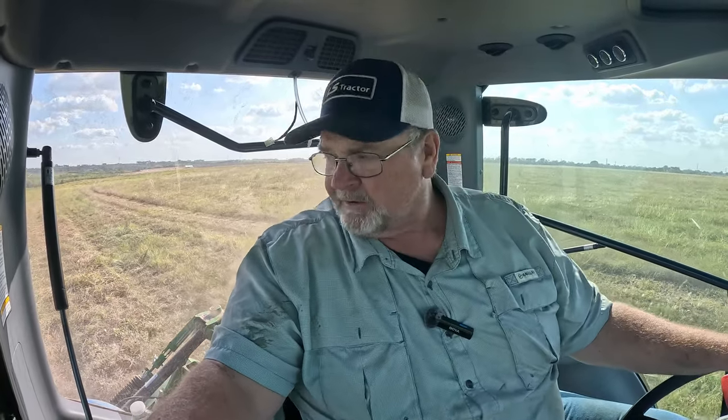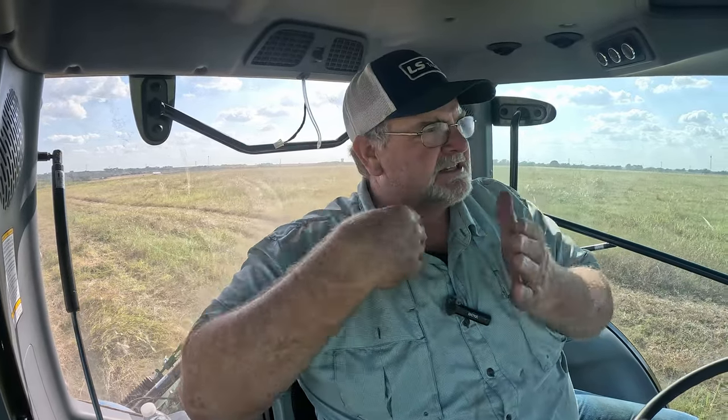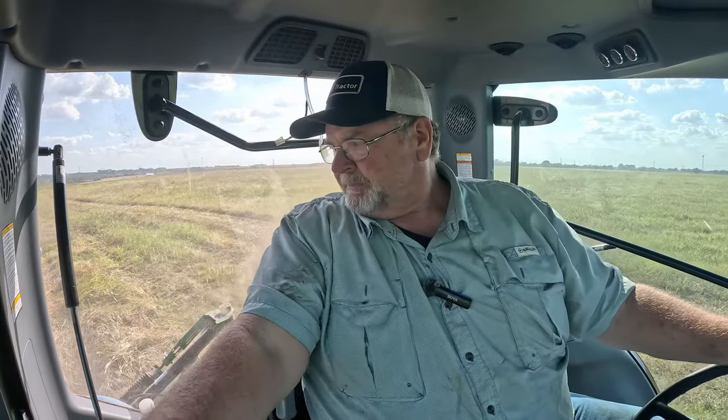That's what it did a couple times, but then it started doing it a little bit easier. I checked my welds and all the area that we did the repair to — that all still looks good. All I did was slow down a little bit. The field's just too rough to go very fast — it bounces around and snaps it like that. But I tightened it up a little bit, and it seems to be fine now.